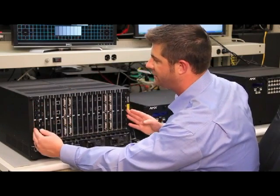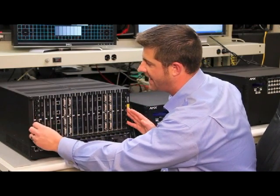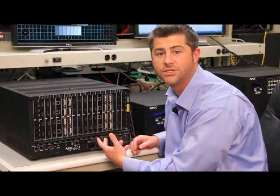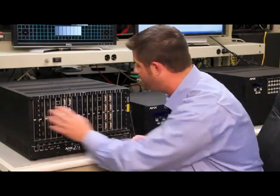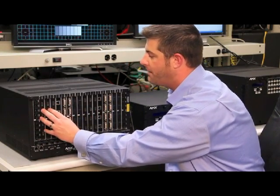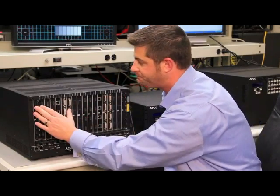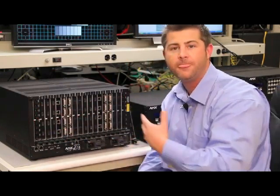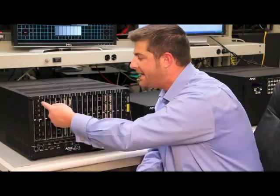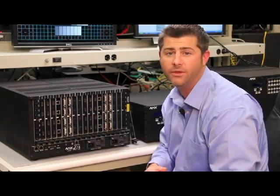Finally, the audio insert extract boards. On the left and right-hand side of this matrix, we see the audio insert extract board slot. Because it's a special slot, I'm not consuming video input or output board positions. By adding these boards on either the input or the output side, I gain a way to access the embedded audio on the first 16 inputs or the first 16 outputs. That allows me to remove the embedded audio locally, or to add audio to make it an embedded part of that HDMI line for video-only style inputs.